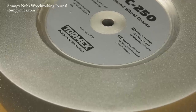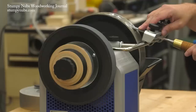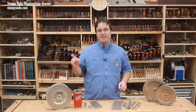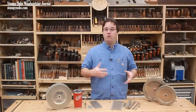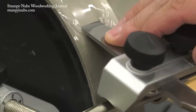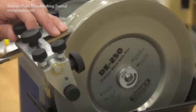I use diamond wheels on my Tormek, though, because I believe they'll last longer than the CBN wheels on a slow-speed system like that. But the available CBN options are less expensive than the Tormek diamond options, and CBN tends to be available in a wider range of grits. So personally, I plan to stick with my diamond wheels on the Tormek, but I may add a couple grits of CBN to my set as well, possibly a 200 grit for a really coarse grind.